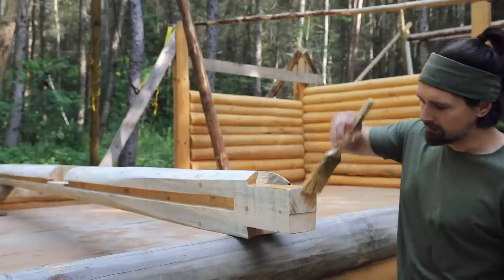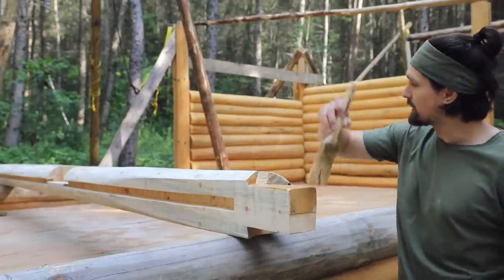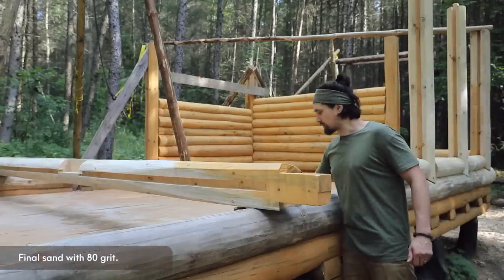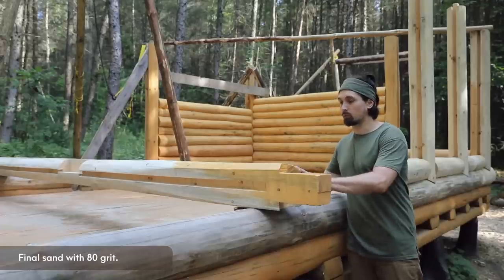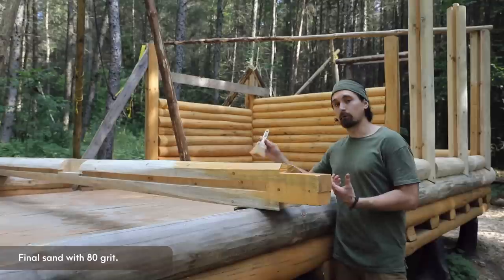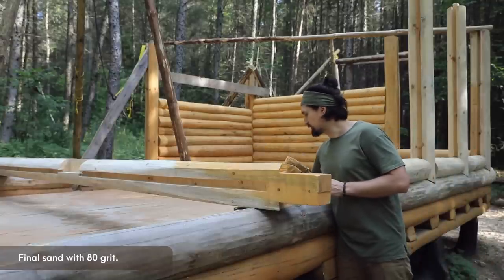This is a pretty exciting day. This is the back center post, and I'm hoping to get it stained and put up in position today. I sand prior to staining to give the wood a bit of a texture that allows the stain to get something to grip onto and soak in. And I'm using a Sansin SDF.